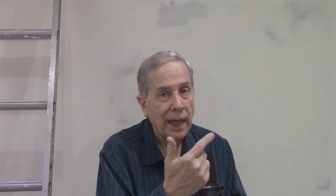There is an air conditioner that runs in both directions, so it's really a heat pump to provide heating and air conditioning. Heat pumps are not real good for heating, and this one does not have strips in it to provide extra heat, but the room is so small that a small electric heater would work fine. It operates on a remote control, which I've kept on the front of the sub-panel just because there's a magnet in it and that's a good place to stick it. So I can turn it on and set the temperature — and because it's above the door, it's not easy to get to. The ceiling of the room is about 9½ feet tall.